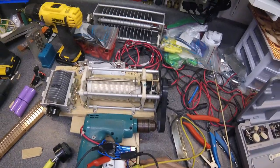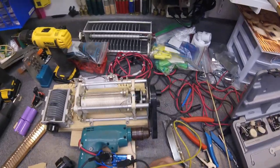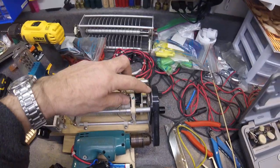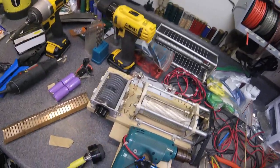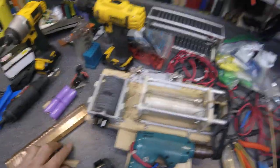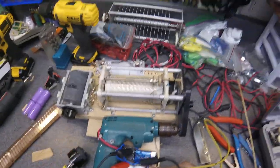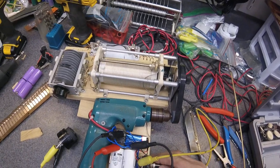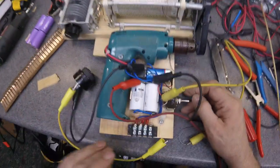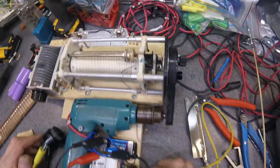I might have to put another shim there, or I could bend the contacts out a little more — I have to fudge with the contacts. Or I could put a shim piece up in here, make another yoke to glue up in there, a piece of shim stock, to get it to sound the alarm just a little bit earlier. I think I went a little earlier — but anyway, there you go. I hope this little GoPro cam was able to get up close enough to see this thing in action. I think it's pretty damn cool. See you later.